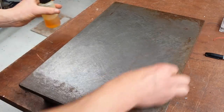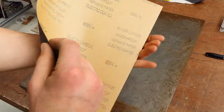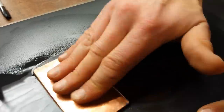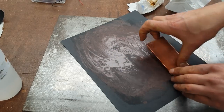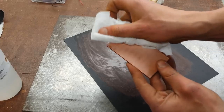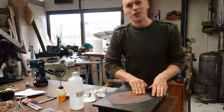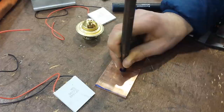So I've got my old surface plate here — it's still flat in some places. This was actually scraped very flat at one point. This scrap of copper is very unflat to start with; it's just a bit of old bus bar so it has no reason to be flat, but we want it to make as close contact with the TEGs as possible so it's getting flattened slowly. The trick here is to start with a nice low grit and work your way up. I started at 600 and I was way over-optimistic about how flat it was. It's definitely a tad tedious but it's probably worth it to get a really good connection.